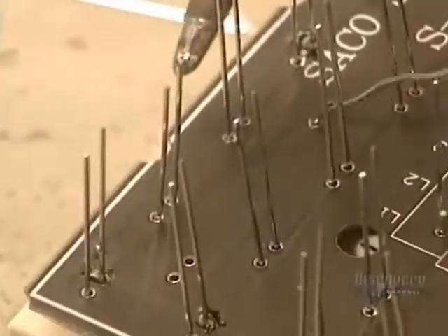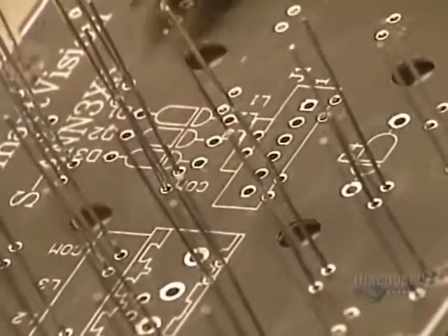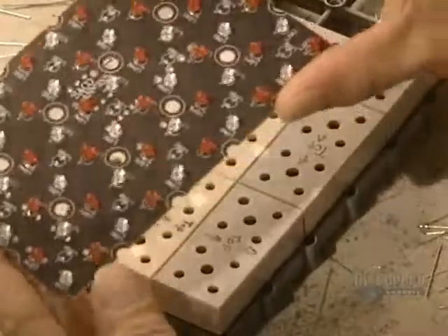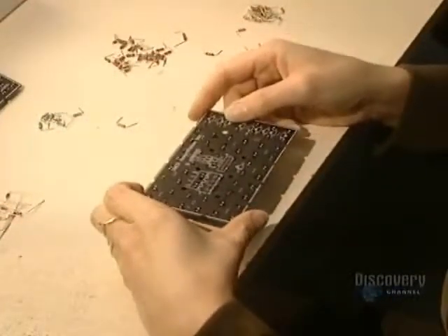These elements have to be placed so as to form a matrix. Each of the 20 machines at this plant can install and solder 1,500 elements an hour. Lighting up an element requires only 10 to 20 milliampere, and they last for about 150,000 hours.